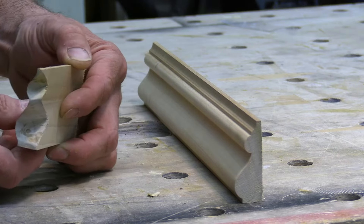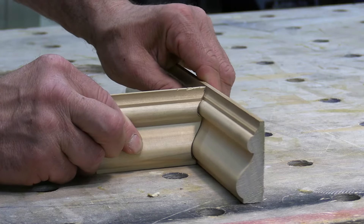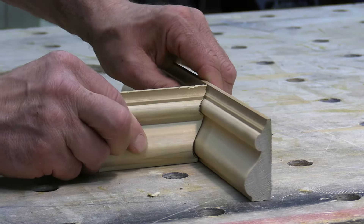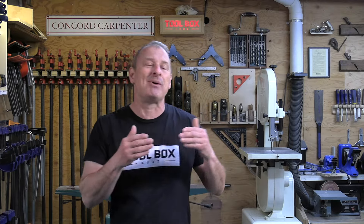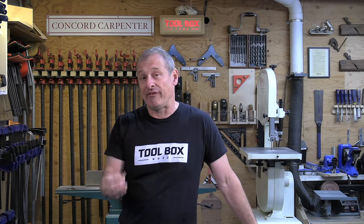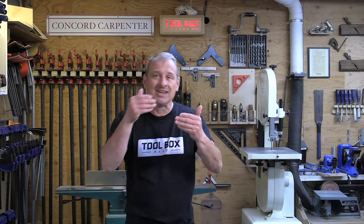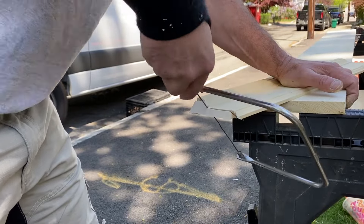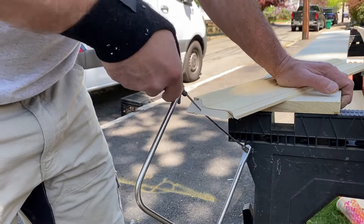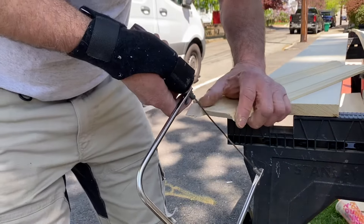Mitering inside corners is not the preferred way to install molding. The problem is that most walls are just not 90 degrees — when less than 90 degrees the molding shows a gap at the rear; when greater than 90 degrees it shows an ugly gap up front that you'll have to caulk or fill. Coping molding is done by cutting one of those moldings back 45 degrees, allowing only the front edge of that molding to touch the other molding, creating a tighter joint. To cope a joint is to precisely cut along the profile edge of the molding — not at 90 degrees — removing enough material at the back of the workpiece so it slides over the mating piece for a perfect fit.